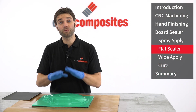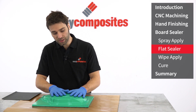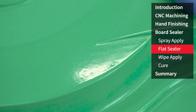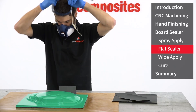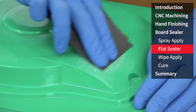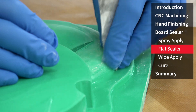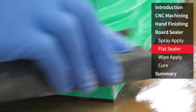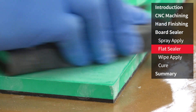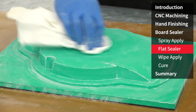Having applied four spray applications it's now been left for several hours to fully cure on the surface. We're left with a few small nibs on the surface that we're going to just knock out with 1200 grit paper. This flattening and denibbing operation is only required when surface finish and flatness is of paramount importance. However you will find the operation to be very quick and easy as all of these imperfections are in the positive, so it takes a bare minimum amount of effort to remove them.